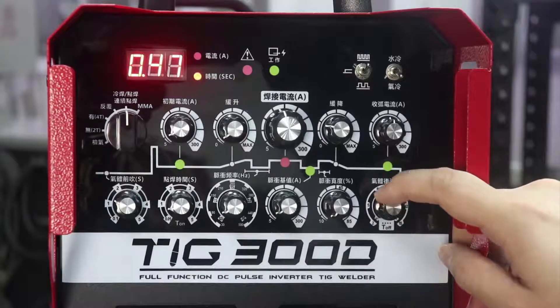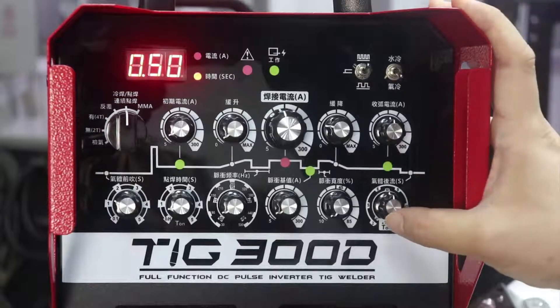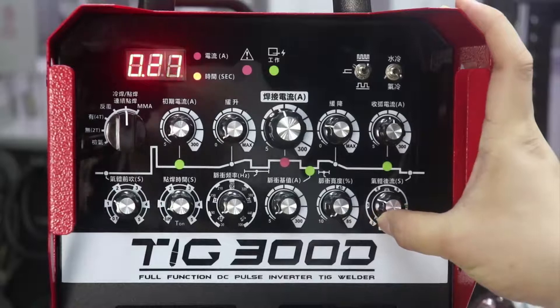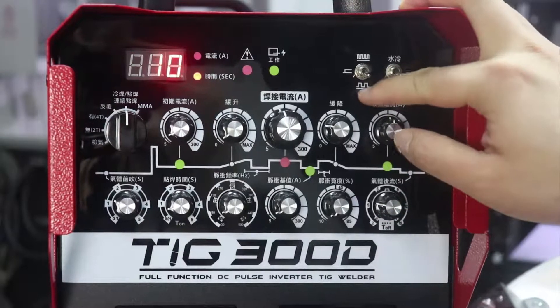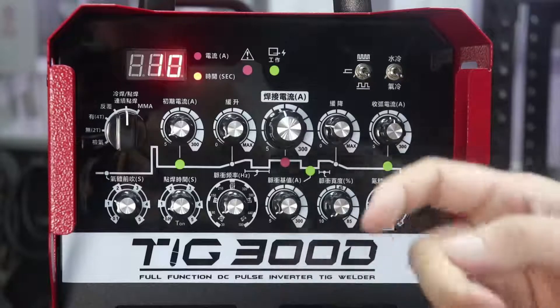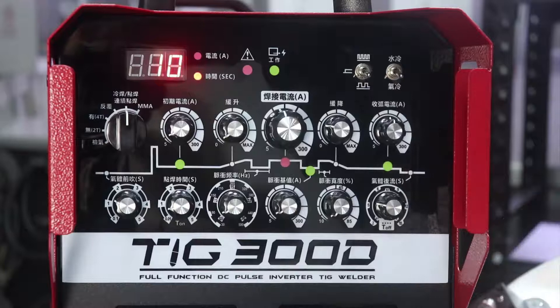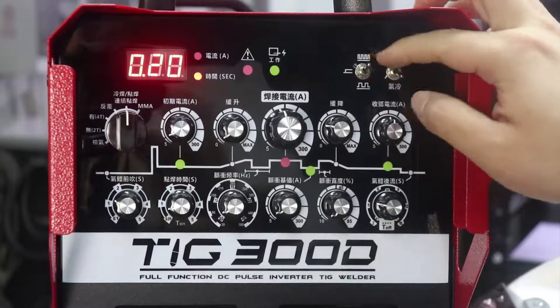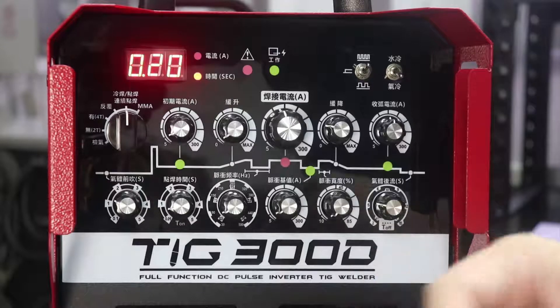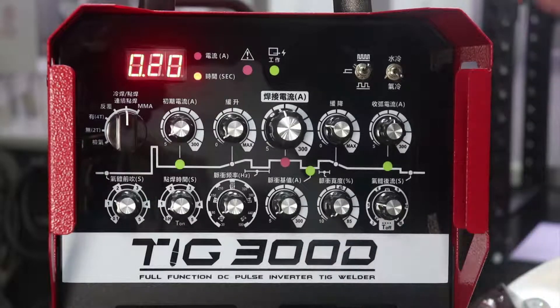For the top position, you can adjust the gap time or T-off time. For starters, I suggest using 0.5 or 0.6 seconds. If you are an expert or professional welder, you can try 0.2 seconds. When using single spot mode, you get one weld per trigger press — pop, pop, pop. For continuous spot welding mode, just hold the torch switch or foot switch and the system will keep spot welding automatically — dot, dot, dot, dot.